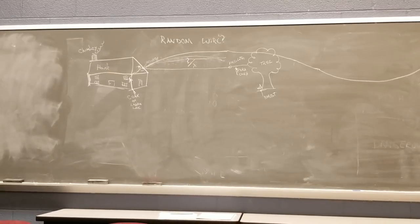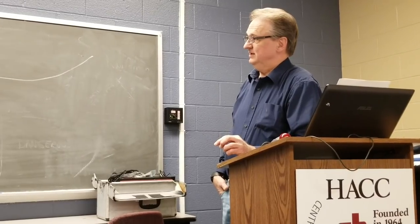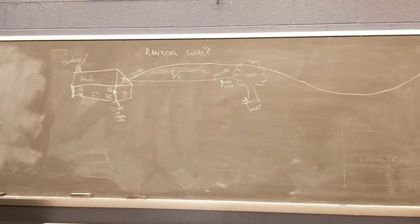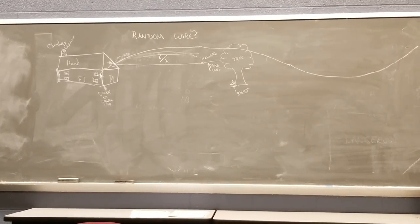Right. Unless you don't want them to be where they are at a high impedance. Well, for starters, let's just say we don't want something that would be, say, 1/4 length on 80 and 3/4 wavelengths on some other band that you want to operate. We want it to be either longer than 1/4 on 80 and, right, you know. You're ahead of me. I see. Okay. Well, I'm sorry, that page wasn't in the notes. He's right, but we're getting to that.